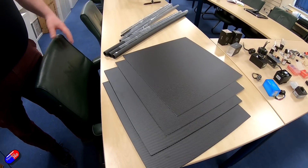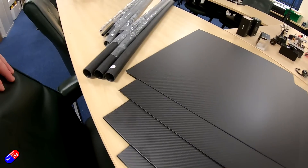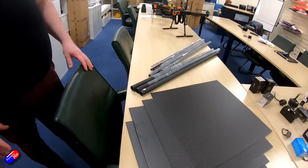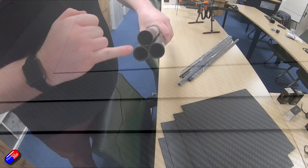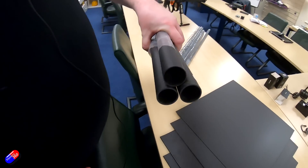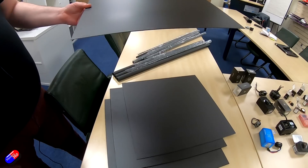It's something we've always used — we make custom or modified drones so we've always needed carbon fiber for ourselves, and it is hard to find a good supply or have products made to your specification. What we're now offering for sale is what I think is the best. We generally found matte finish is the best. We have tubes from as low as 6mm and currently up to 40mm outer diameter, with a range of wall thicknesses — for example for 30mm tube we have 1mm, 1.5mm, and 2mm wall thicknesses so you can choose the most appropriate strength for your build.